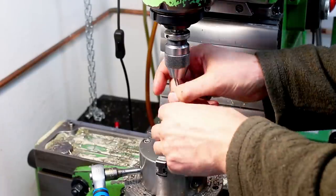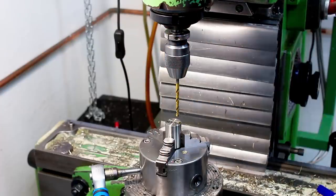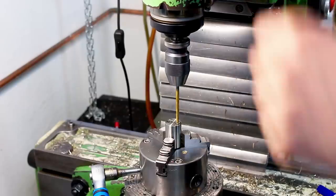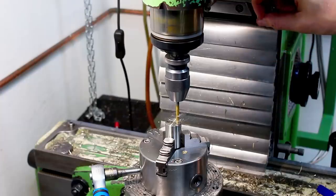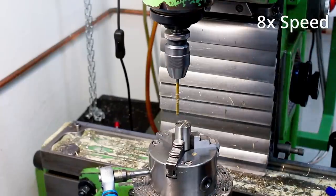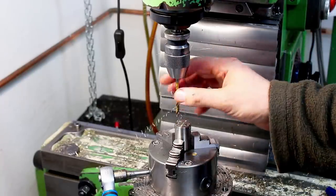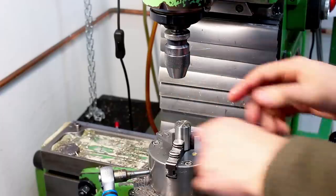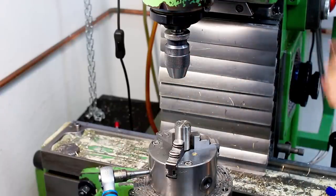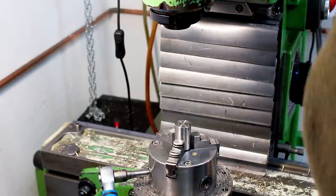You have your 4.5 millimeter drill. It will remove 0.25 per wall, and if you add a little bit of cutting oil, that's a very economical way if you don't want to use a reamer and still want a pretty okayish hole compared to just slamming a regular high-speed steel drill into solid material. That's my 5 cents on drilling. Drill chuck comes out, carbide end mill goes in.